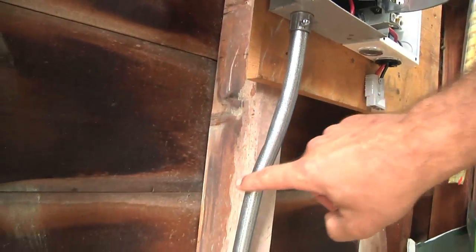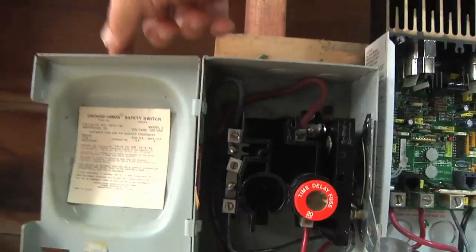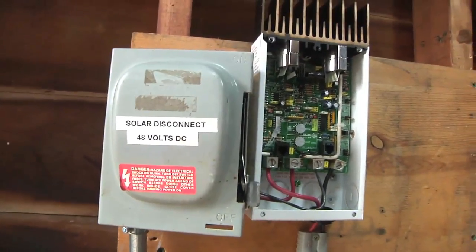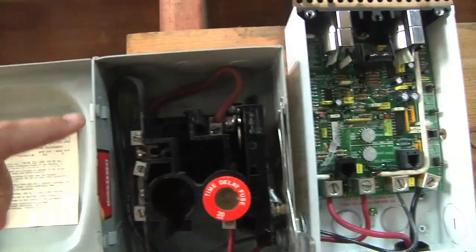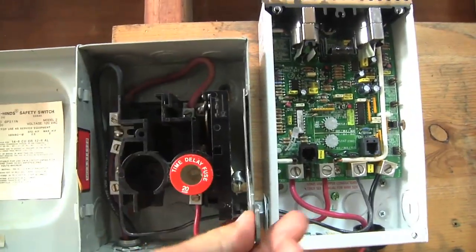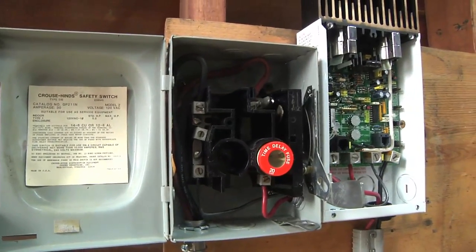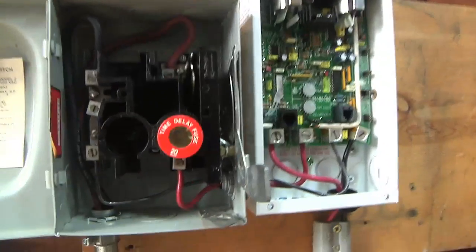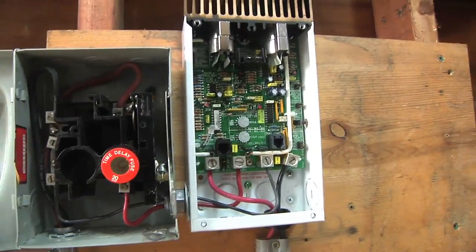Up here I had to offset a bit and I didn't have a conduit bender, so I just stuck some of the conduit in my anvil through the hole and used that to bend it. What I've got up here is a safety switch — this is my photovoltaic disconnect box. The black wire and the red wire are the negative and positive from the solar panel, and they go through a switch and a fuse. So this is my big on-off switch for the solar system, and the switch can even be locked in the off position.